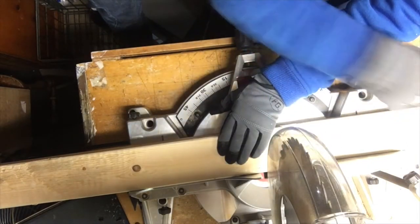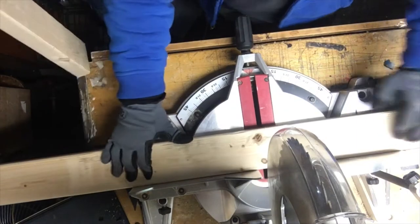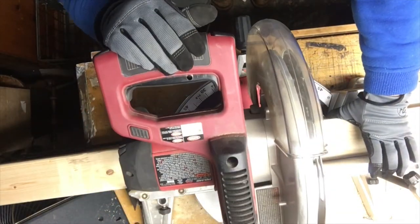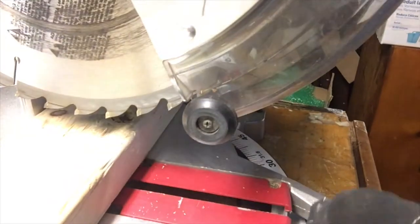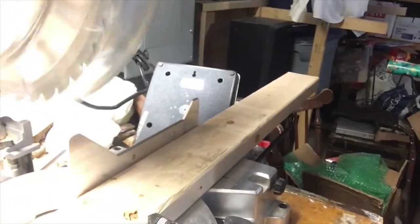Albert's got this — he's a woodworker. I'm a metalworker, so we know the problems here. Now you have your line. If you have a laser saw it's a lot easier, but you want the edge of your blade — this is called the kerf of the blade, this bottom of the teeth here. See how the thickness of the blade — that's called the kerf. The edge of this kerf needs to be on this line, because we're gonna remove material. If we go exactly on the line, you're gonna remove more material than we need to. You want the edge of your kerf to be on the line — just like that. Now you can cut.